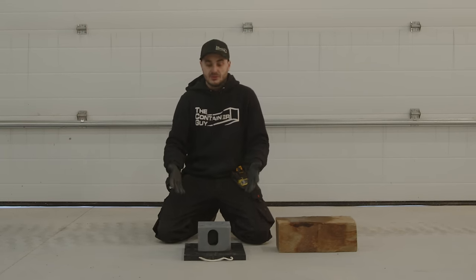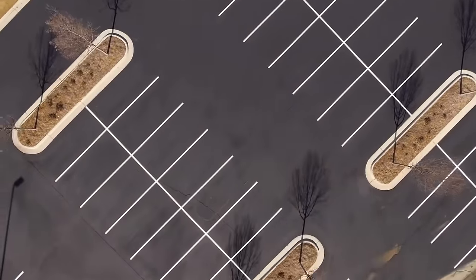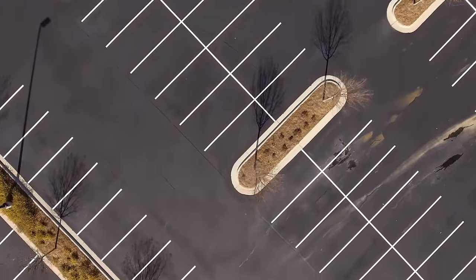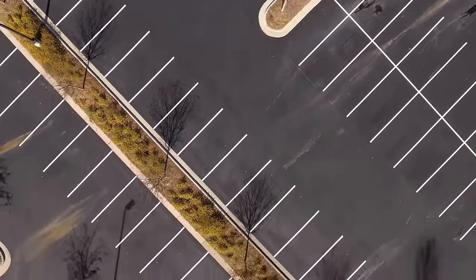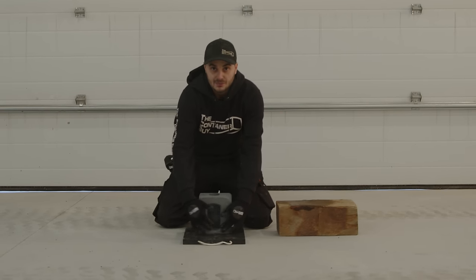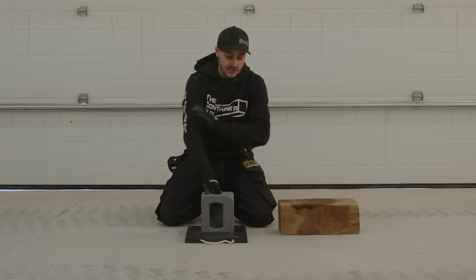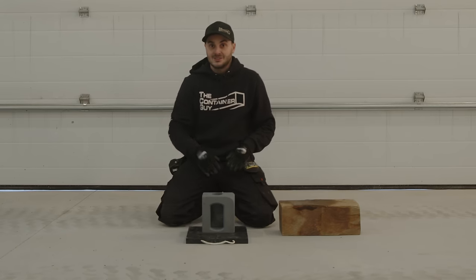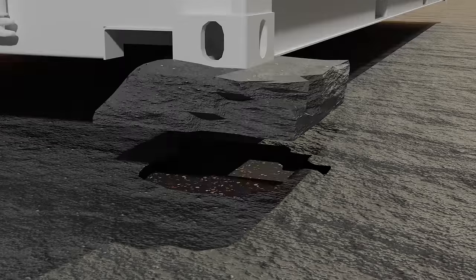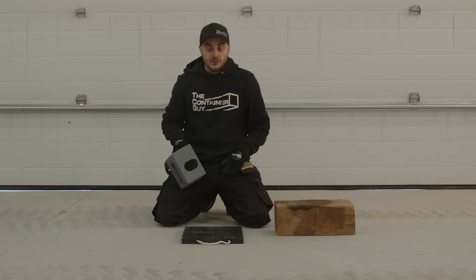For people that potentially wanna utilize these in a parking lot, say you're putting it on asphalt, the sun can beat on the shipping container to make the container hot. It can beat on your asphalt, make your asphalt hot, and then you can actually stamp right into your asphalt the shape of this casting, because this is 12 millimeters or a half inch lower than the rest of the container. And sometimes I've seen really bad cases where we lift up the asphalt when we come pick up a rental. So this is another good idea for asphalt parking lots.